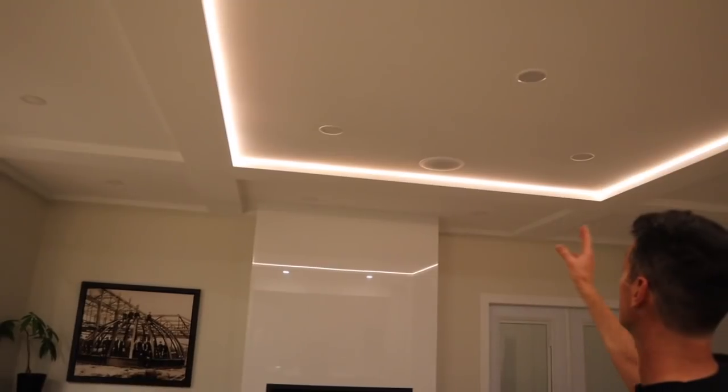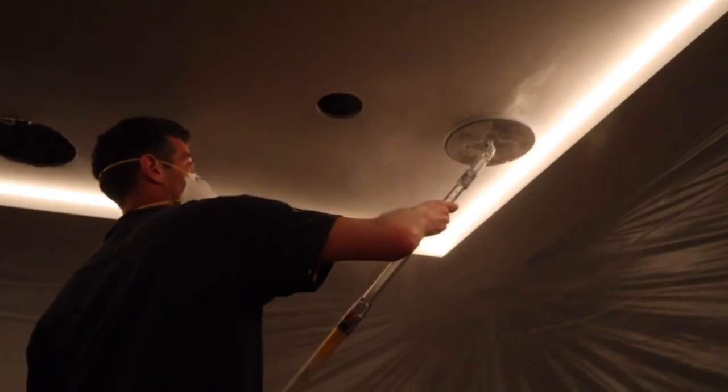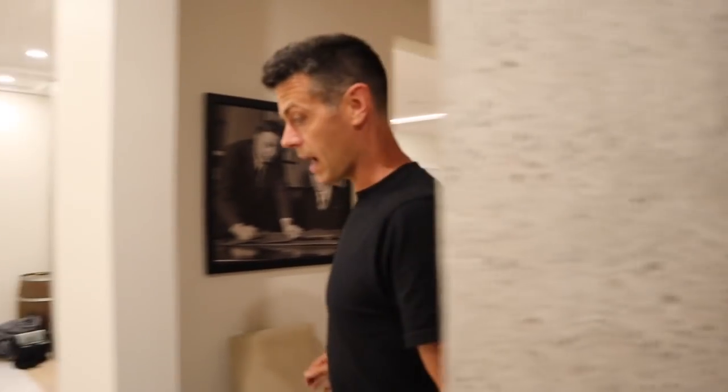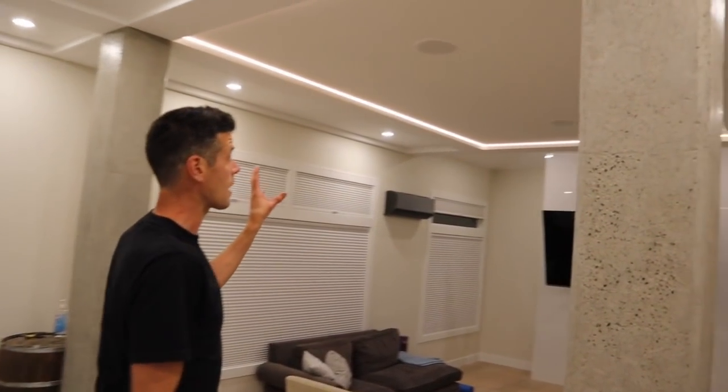There was a few scratches in this ceiling from using that big Richards sander that I tried to use, and I couldn't see them because when you sand ceilings a whole bunch, what starts to happen is you get like snow blind, where you're just staring at white, you've got dust falling in your eyes, and you just can't even see anymore. So there was a bunch of scratches there. They're not so bad as long as you don't hang out here scrutinizing them. But this one I switched over back to just my foam-backed sanding pad, and this one looked really good. I was happy with this one.